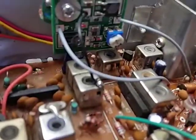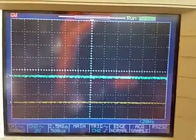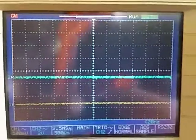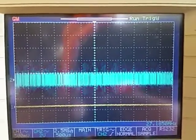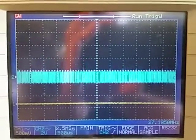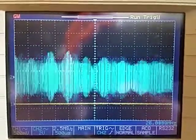The variable control controls the dead key output. Here's a close up view of the scope — this is a dead key. According to the digital it's about 0.95 watt dead key. But the point right now is the waveform. We can see a nice rounded waveform because the limiter is in there.